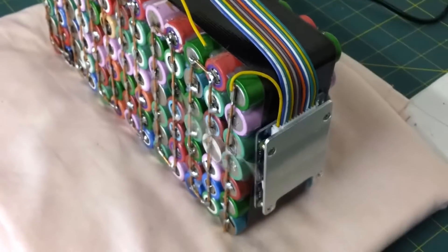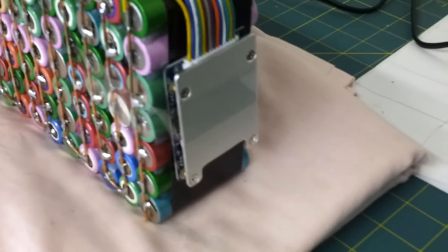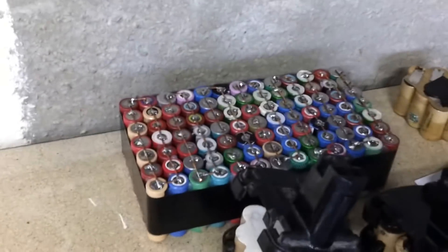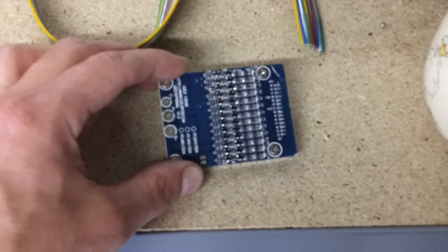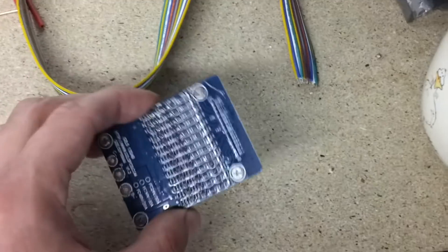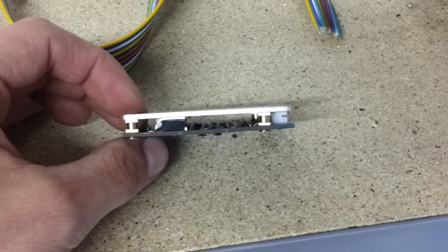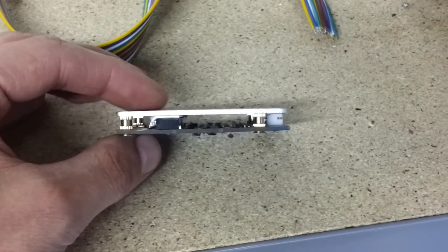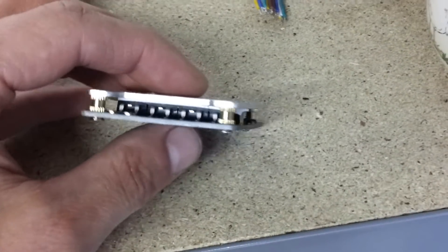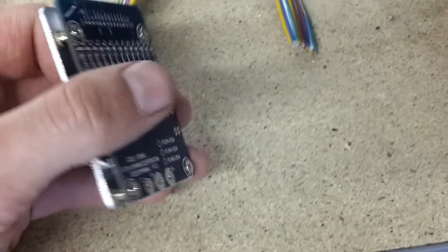My two BMSs have arrived, one for each battery pack. I'm now in the process of soldering this one on. Here's the other one — give a bit of a look at it. It'll be going on that battery pack there. It's really cheap. There are some of these for a lot more money — doubtless they're a lot better. Will this one do the job? I hope so. My e-bike build is a budget build, so I'll go for this, and if I have problems I can upgrade to a better one in time. It has got a heat sink — this large plate of aluminium — with thermal paste on the components to transfer as much heat as possible.